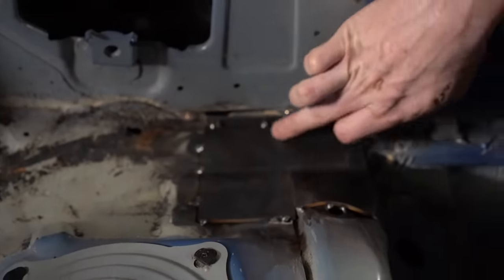We're at the final stages of building the roll cage. We're about to put in the diagonal brace and the harness bar. All of that goes right within the main hoop. The reason I'm doing this almost last is because I had to pull in these tubes in order to weld the outside of the doors and stuff. So that's why I do it last. Plus it's a bit easier to come in and out of this area to weld spots that are already welded now that I can do it.